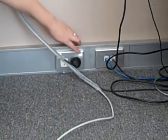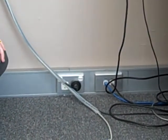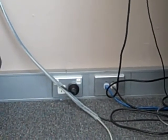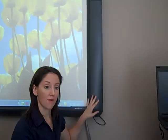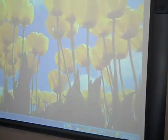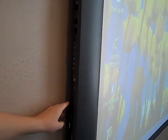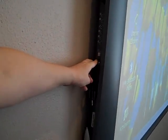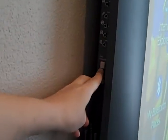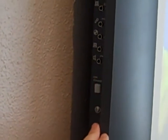After two minutes, turn the board back on. When you turn it on, you also need to turn it back on using the button on the side of the board if you have one of these boards with the black frame. If you have an older board with a grey frame, you won't need to do this. The button is over here — you'll see the volume knob and some ports, and there's a little white button with a red light behind it showing it's off. Press it once and the light will turn green.